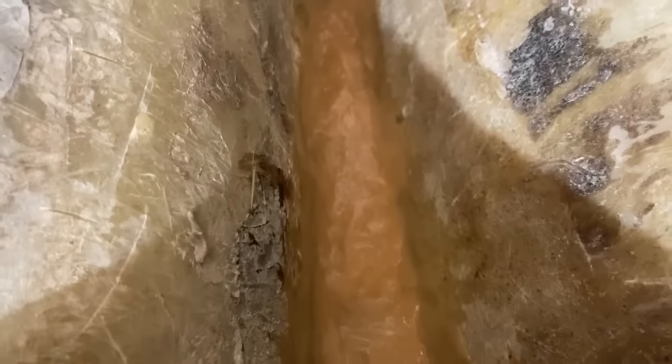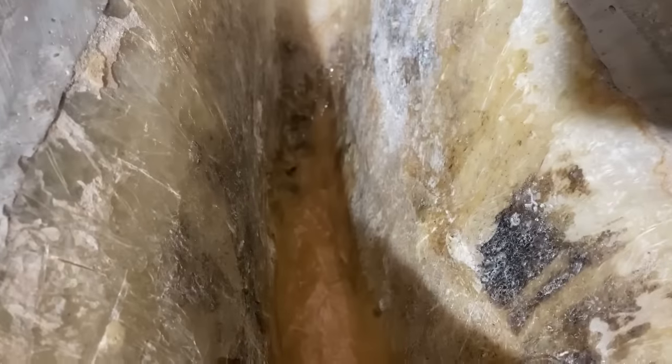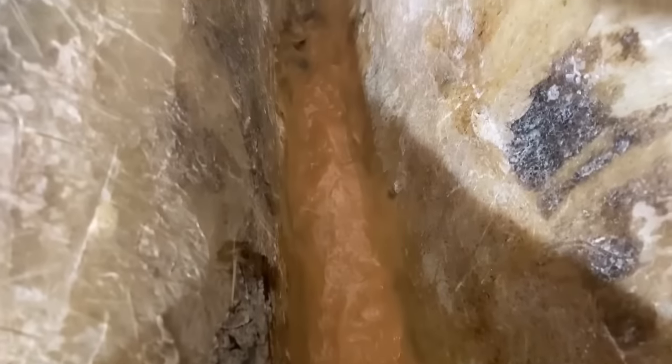I was planning to put a foaming epoxy in there because it's a structural foaming epoxy that will help hold the stern tube. But instead of that, I have mixed up some resin, which I've thickened and added some chopped glass strands to, and poured that in over the top of the stern tube, so it is bonded in much like the original tube was bonded in on this boat. So it doesn't really need that structural foaming epoxy, so to save time, save a bit of cost, I'm going to use a polyurethane foam in there tomorrow.